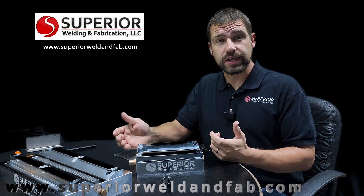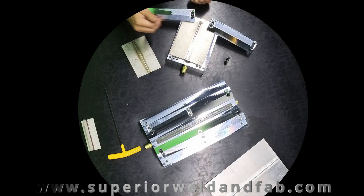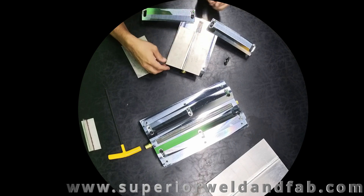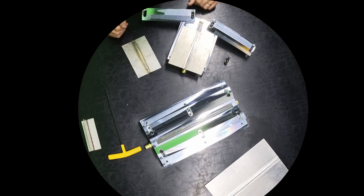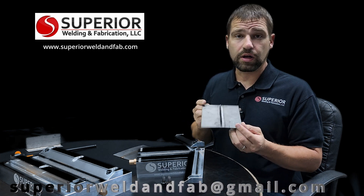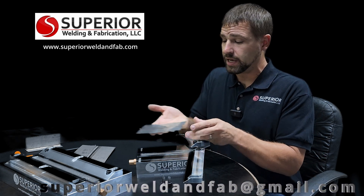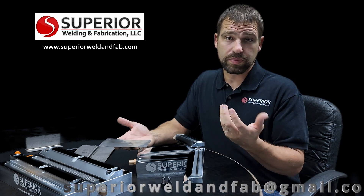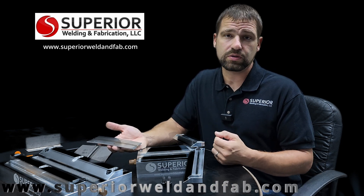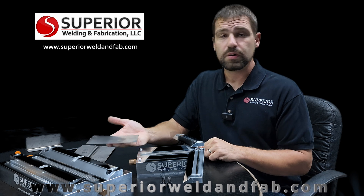What can you expect when taking a weld test this way? Here is a titanium example welded ahead of time — on the top side you can see very good shielding. The hold-downs were held very close to keep cooling consistent. On the back side, it's nice and shiny, nice and clean, no discoloration that would cause you to fail on a D17.1 welding inspection. We also have a stainless example — on the back side you have your straw color or better, and decent coloring on the front, which can be improved with a trailing shield or better shielding gas.